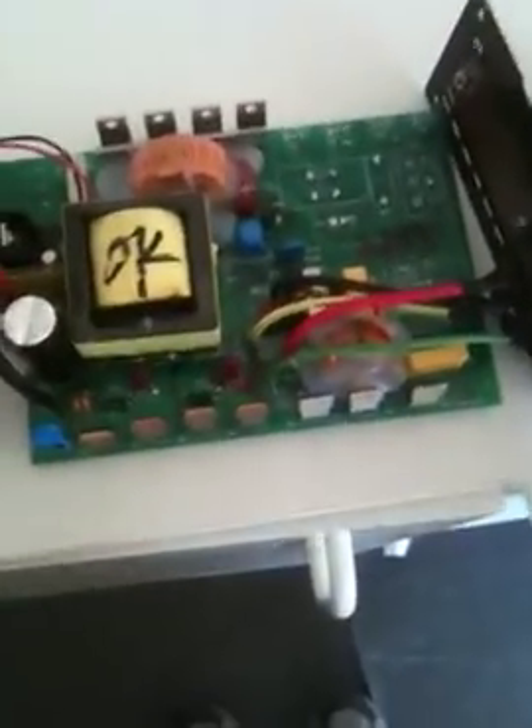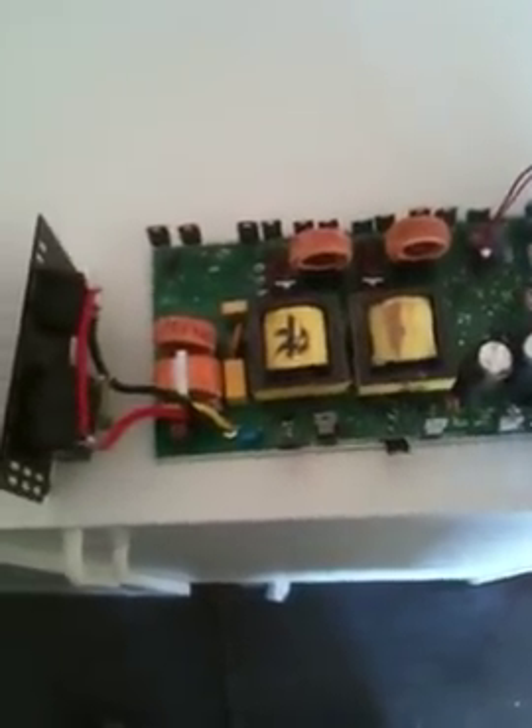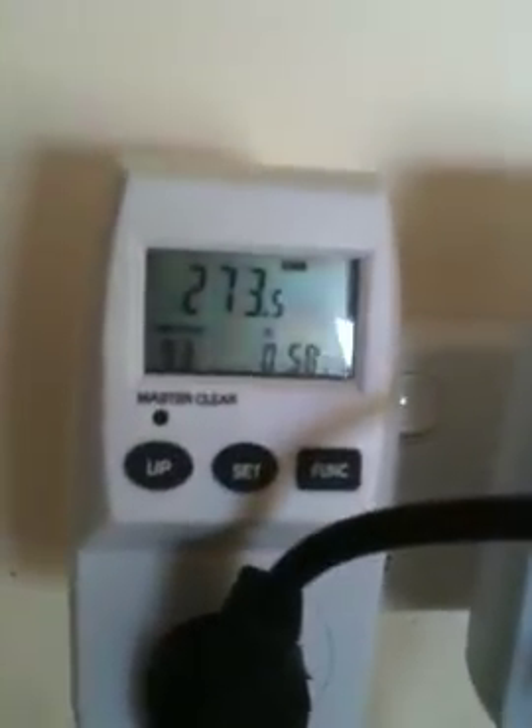I have bought a couple of cheap inverters that have blown up. One arrived with the other 300-watt and it died — the main fuse is gone and so are a couple of the diodes. And here's a 600-watt one that's also gone. They're sending parts — costs 25 bucks in freight — but there's a fair bit of soldering to do to fix those up. I'll get those hooked up and split the load so I'm not running so hot, because this one's fan runs constantly and it's running way too warm.